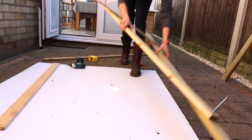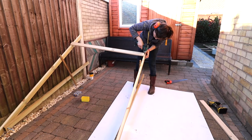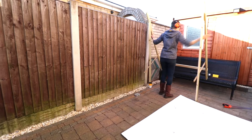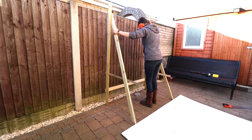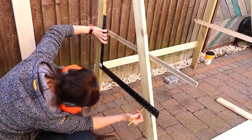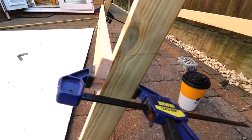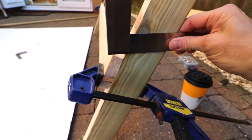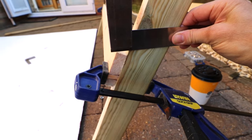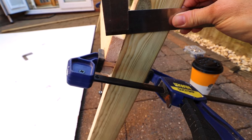Next I pre-drilled and screwed a 1.2 meter length back support on. I don't think I'd go much longer than this, but obviously if you want it shorter for a narrower plant stand, feel free. Now I'm transferring the same measurement at the front but using my right angle to match the height, because this is where my next shelf support is going to go. Remember, with it being on an angle, you've got to have the tallest angled piece in line with that reference, otherwise your shelf is going to be on an angle.